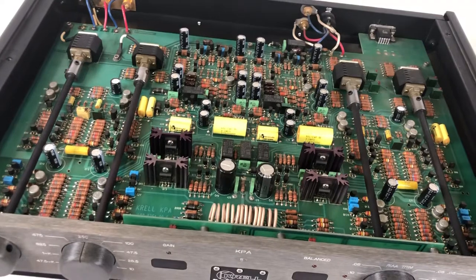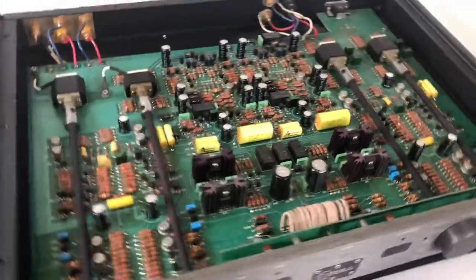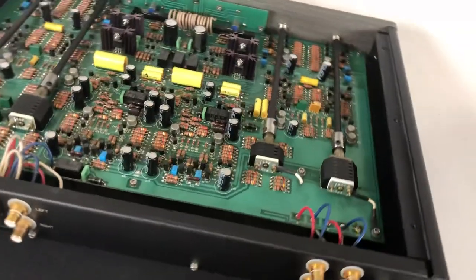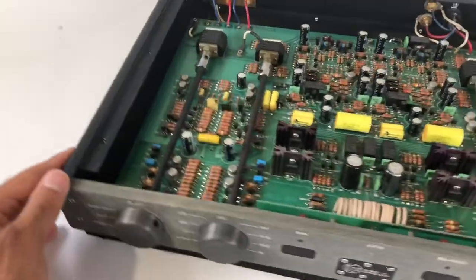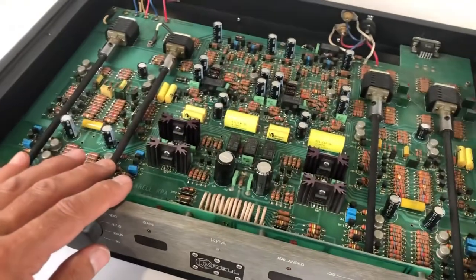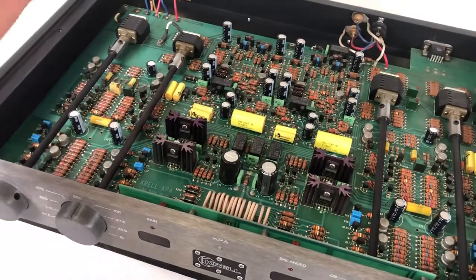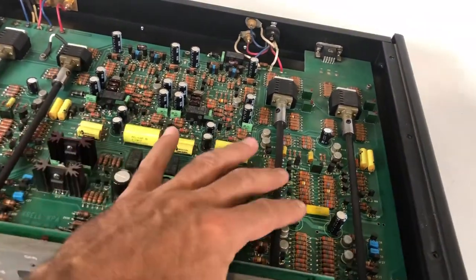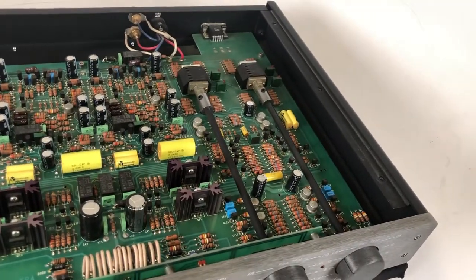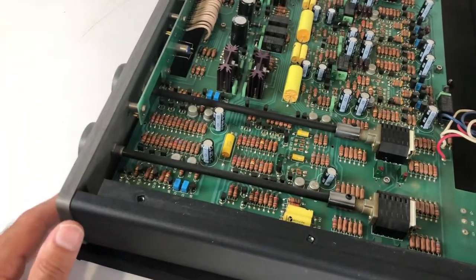Common in a lot of designs, but certainly executed here by Krell. Just a plethora of stuff — it's really crazy and the parts quality is top-notch. High-quality PC boards, mil-spec resistors, transistors, etc. This center section here is likely the power supply — even though you're using external, there's some additional regulation that's local to the unit. This is your input selection, your cartridge loading, power supply, and then to the right we're going to see the two RIAA trim controls. They use a ton of resistors in order to load them up, probably just keeping adding them to the signal path.